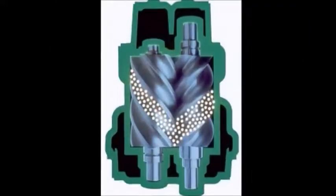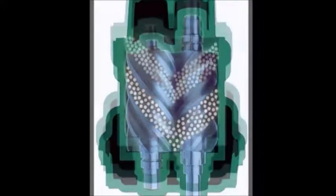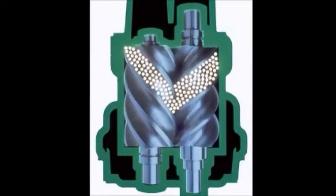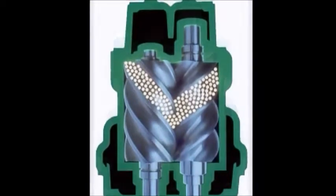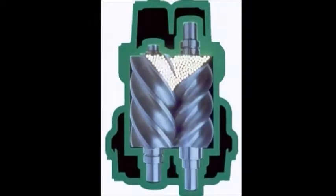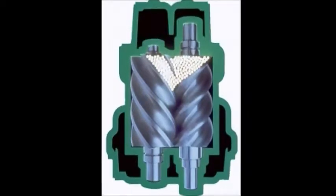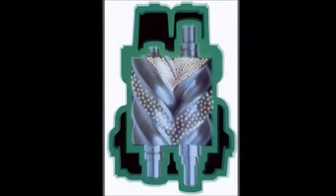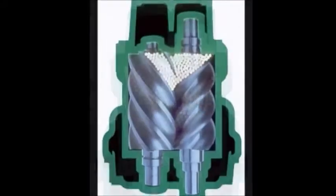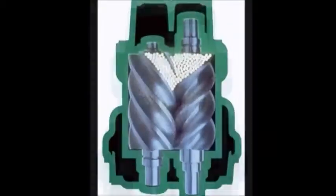The next cross sections of the pump illustrate air being drawn in through the inlet port, then compressed air is transitioned to the exhaust port via the precision helix rotors. The combination of a highly durable design and world-class manufacturer Rotocomp is exactly why Polar Air gives a 10-year warranty on all of our air-end pumps, provided an annual service kit is purchased through Polar Air. Our service kits are one of the most competitively priced in the industry.